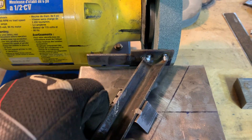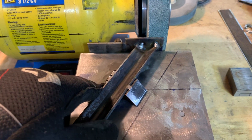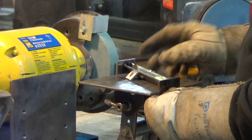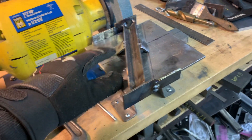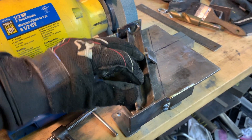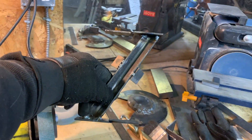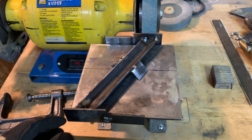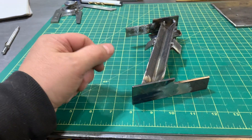As you can see, I've made a few modifications. What was happening is that this thing would pivot, so it wasn't holding onto the table correctly. I didn't want to start from scratch — there's got to be a better way. So what I did is I extended these lips, or retainers — fences, shall we call them — and that fixed the problem. What you're going to make is a Z-shape. Anyway, it fixes the problem. So I'm going to cut this up and carry on, now that there are only a couple of steps left.